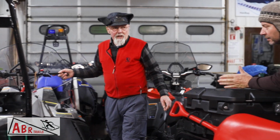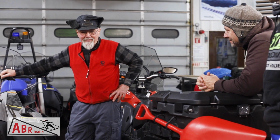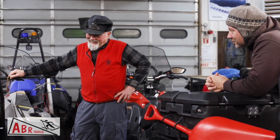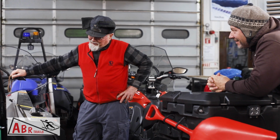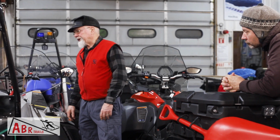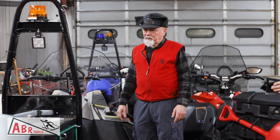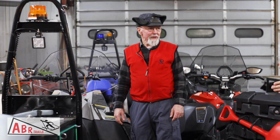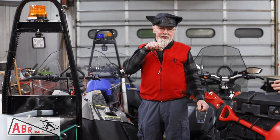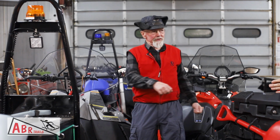So now if I go off track, where the snow is going to be a lot deeper, and either turn it or roll it over, how do I get it back upright again? Well, call for help. First time, maybe you would call for help. Generally, because the Arctic Cats weigh like 860 pounds, or a little bit more, and the Ski-Doos are about 100 pounds lighter, nobody's picking that up by themselves. So if you can find a way to string your winch cable to pull it up with the winch, that's what you do. Otherwise, you have to call for help, and somebody else will come with another machine and a winch and pick it up that way.